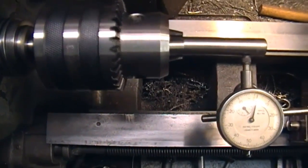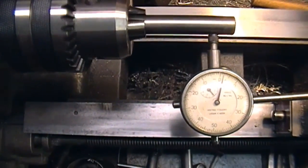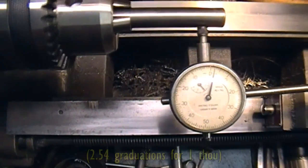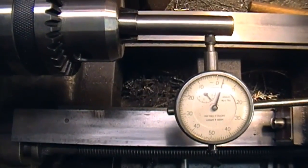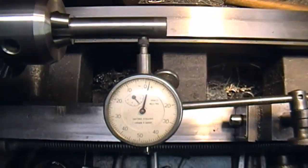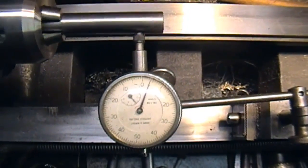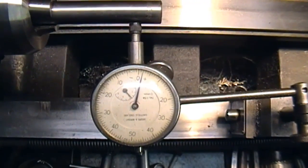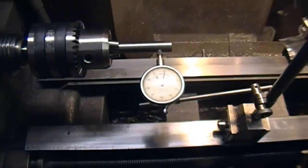Sorry, the indicator is very jerky — anyway, it was just to give a bit of feedback on that. It works out to be about a thou. I'm not sure if the drill rod is dead smooth or whether it's got a little hiccup on it, but it's about three graduations, so just over a thou. Pretty darn good for a budget-priced chuck — not bad at all!